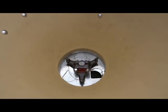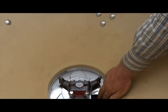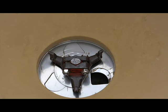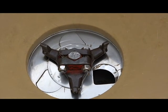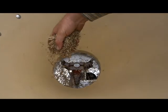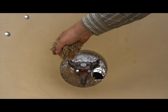Now we're gonna set the Vicon Seeder up for our seed. We've got the agitator out. The hole here is what's gonna let the seed go down and then come out the spout on the back of the seeder. So our seed here is fairly large, but it's not fluffy. You can tell that size of hole, that seed's really gonna go out of there fast.